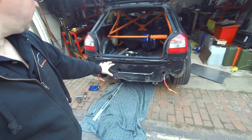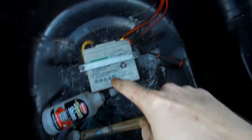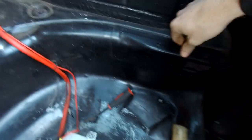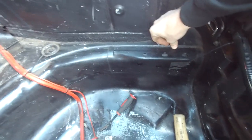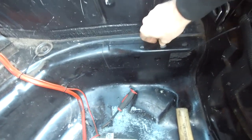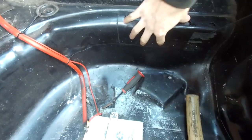Car's up in the air. I've cleaned up the rear panel so I know roughly where I'm going to cut. Now before I do I'm going to have to pop the battery out, and also there's this little reinforcing plate which I think is in some way linked to the towing eye which is right there. So I'm going to drill these spot welds out to get this plate out.